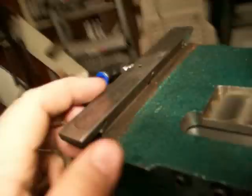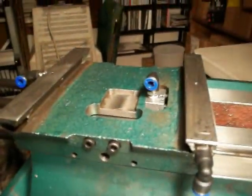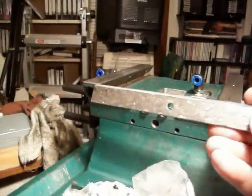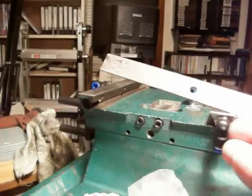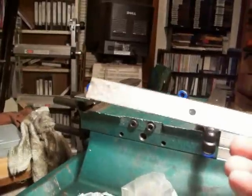That's the actual original hole that's in there - same thing, it drove down through the top so the oil will come up, go into our grooves we made a long time ago, and keep that oiled. The other side is exact same as this - just a hole in the center that goes in through the dovetail, like the one in the back. There's no gib strip. Same thing on the front - here's my gib strip, I've got a quarter-inch hole. I drilled the marker hole in there while it was still assembled so I know approximately where it should be when it's put back together. A quarter-inch hole just gives me more room for adjustment down the road and I'll still be able to get oil in through there.